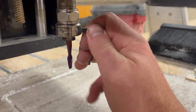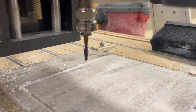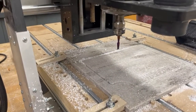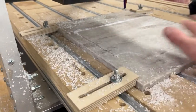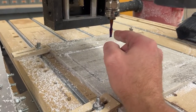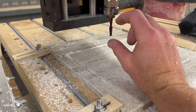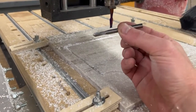It's a little bit tricky to videotape as well as install router bits. Just like before, right before we started running our piece, we always want to re-zero our Z whenever we change out our bits, because I can guarantee you that I did not put in this bit at the same length as the previous one.